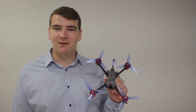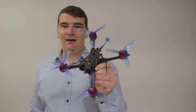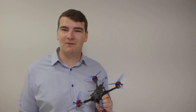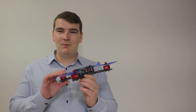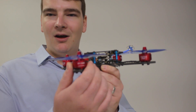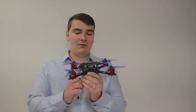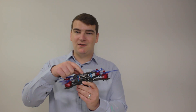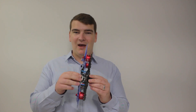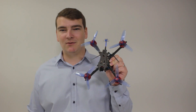Hey guys, I'm Dave and I'm sure you've all seen the $99 build that UAV Futures did. So I'm bringing you the $150 build. This one's actually a competitive racer and we're going to show you what it does out at the park. We've got the Racer Star 2508 motors — these guys are gnarly. We've got a Foxeer Monster Mini Pro, the Mamba 40 amp stack with the F405 flight controller, and old trusty TX805 from Eachine, all packaged in this Union Racing frame. It's a really nice design and the carbon seems really good quality.